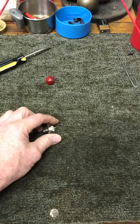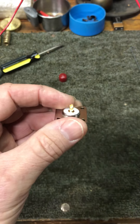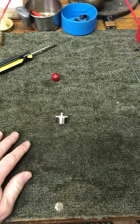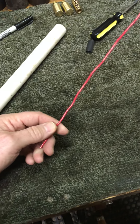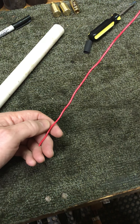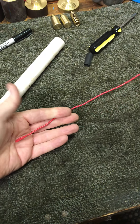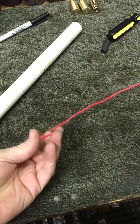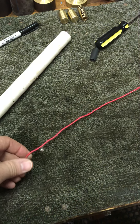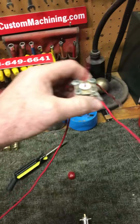To help get out a little bit further on those little handheld ham radios, you can take an SO-239 connector like this, and some 14-gauge wire. You'll want to use solid wire — this is just wire you can get at Lowe's or Home Depot, or strip out of an old junk appliance. You want to use solid wire so that when you bend it, it'll stay put. Stranded wire will not stay; if you try to bend it a little, it'll try to straighten back out.